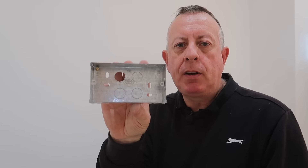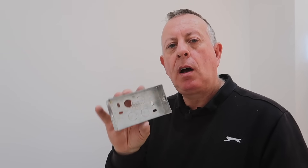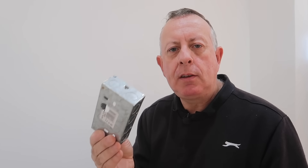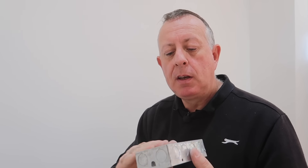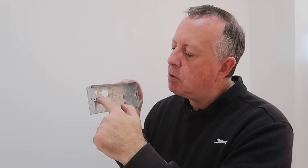My next job is to install the galvanized back box into this hole. They give you screw holes so you can screw it in, but I'd highly advise not doing that at this stage — the back of the hole is rough to say the least, and screwing it in could end up at all different angles. So what I like to do is essentially glue them in place. You can use plaster, construction adhesive, or what I'm using today: this plaster filler. I'm going to put two or three large blobs on the back, squidge it into the hole, level it and get it into the right position, then fill around the outside and let it go off. Only once that's got some strength will I then drill holes and fix with screws.